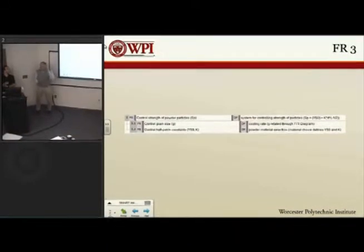As long as we're here, there was a refinement we discussed that you guys didn't pick up on. One of the things is the parent is control strength. Right now, the link between grain size and strength, which is great, and I'm glad you guys showed this. By the way, this is a positive point. I'm trying to speak loudly myself to get this up. So you're showing the relationship, for example, the Hall-Petch relationship here, and I think more people could be doing that. You don't have to do it throughout the matrix, but being able to show how you transform a DP to an FR or a PV to a DP, that's important. And so it would be good to show that relationship and how that transfer is made. And then you can see where other things come into this.